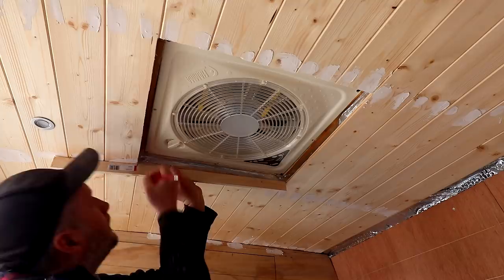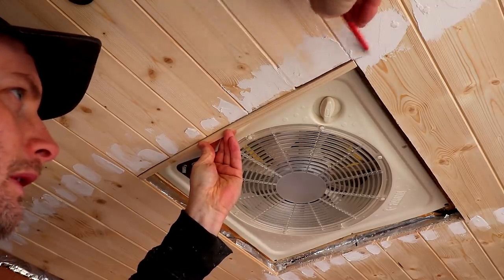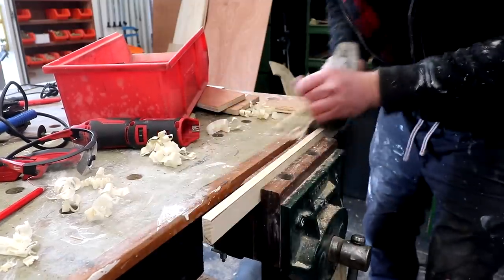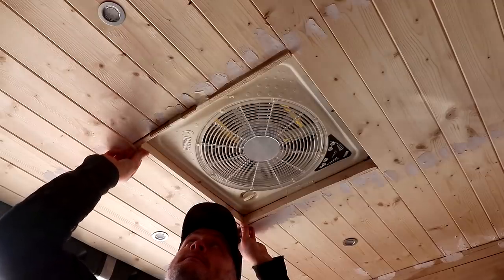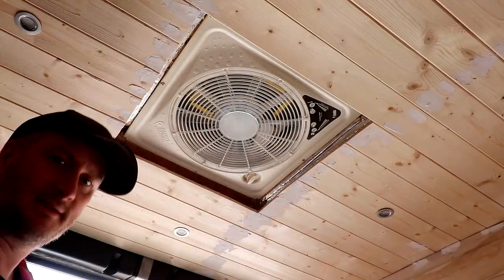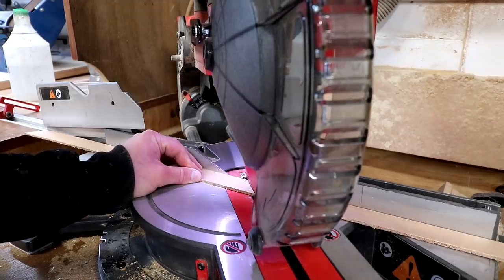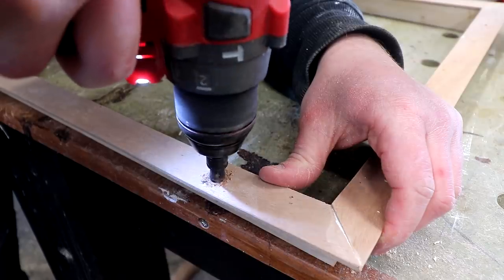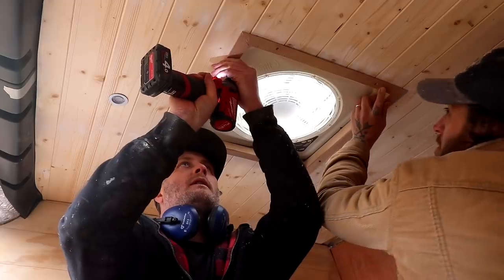For the ceiling fans I'm making a simple box to fit the space around each one using some thin pieces of pine. I scribed them to the shape of the arc of the ceiling and cut that shape at the bandsaw. The sides also needed some material removed so I did that with a hand plane. I offered up each piece and hot glued them together temporarily in situ, then carefully removed the box and reinforced those joints with screws. I then used some 3mm plywood to make a mitred trim which I mounted to the edges of the box. These boxes are screwed in place to the ceiling — no glue, just in case access is needed to remove the ceiling fans in future.